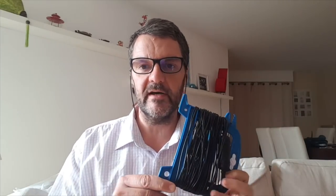For instance, this is a 10-20-40 meter antenna, so the lowest band is 40 meters, which normally would be 65 to 68 feet long, but it's only 41 because of the trap, which is great because sometimes it's hard to find a tree that's tall enough or have a mast tall enough to have a full-size half-wave antenna. And that's their disadvantage. The half-wave antenna is pretty long because it's a full-size antenna. It's very efficient though, and that's the advantage.